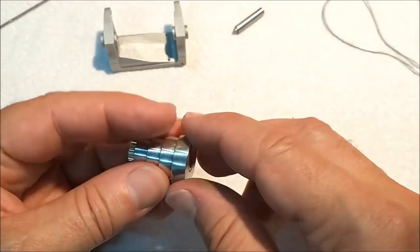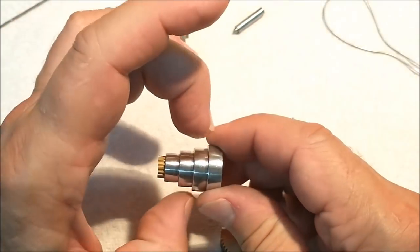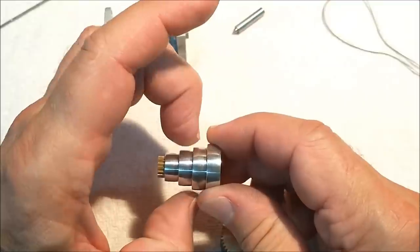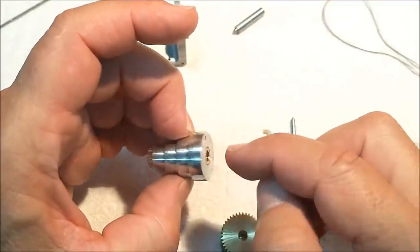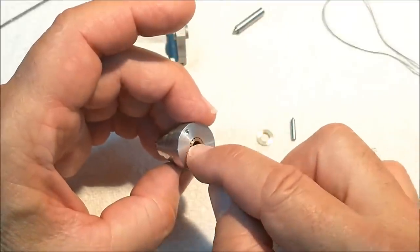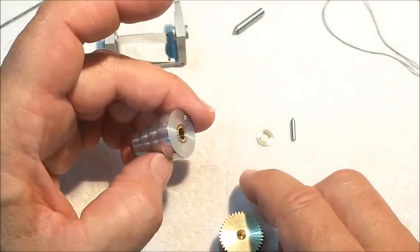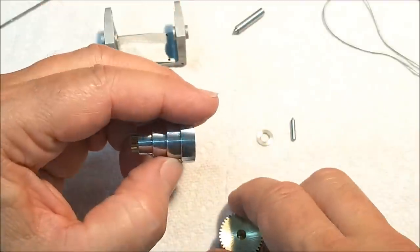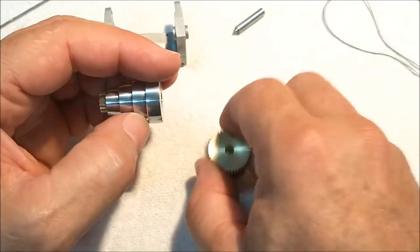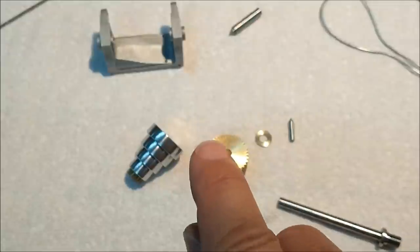So the first thing I'm going to do is put this in the machine, pick some arbitrary number, clamp on this diameter right here — this is a three-quarter diameter. Indicate this, indicate the face, make sure everything is honky-dory. I'm going to knock this center out with a small boring bar until it's just some random size, because size doesn't matter on this. Let's get over to the lathe. I will make some notes, I will make some chips, and I will make this work. Check off one of them things that scares you.